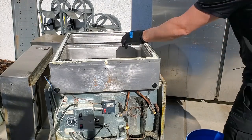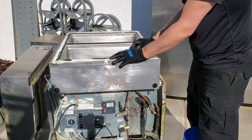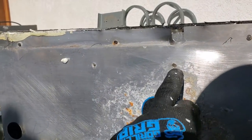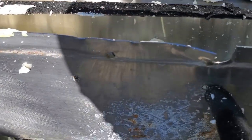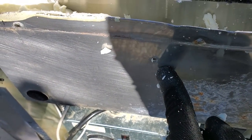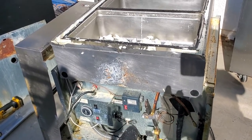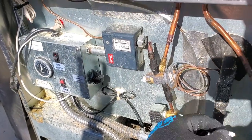I got the top off and I'm trying to figure out how — I have a hunch that water's in here because we had a leak up in here. One of my thoughts was that this top piece wasn't sealed. I also thought that maybe someone put a screw through the back of the box and pierced the glycol in the pan area, but that's not the case. I've got the foam pulled back — there's no marks down there and there's no glycol in there, nothing pink. So I dodged a bullet there. We still haven't figured out where or why the glycol leaked out. This whole area right around this screw had pink glycol running all the way down, and I can't figure it out.